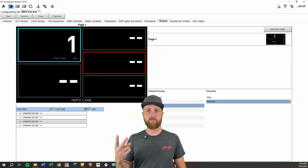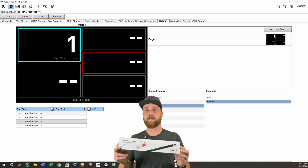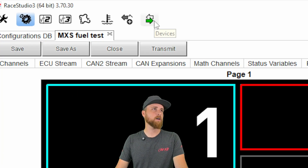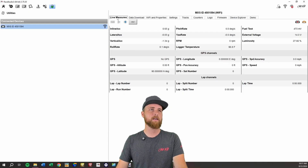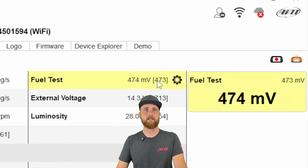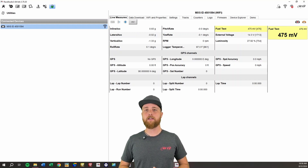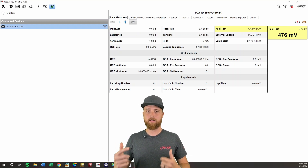Configuration successfully transmitted. Now our hardware is set up and we're able to receive a voltage signal from our fuel level sender. For this example, since I'm not doing this on an actual car, we're just going to use one of our Eclipse linear potentiometers to simulate filling the fuel tank. The next step is getting the actual data points we use for setting up our custom fuel level sensor. We're going to go to connected devices, click on that to populate the side, and it should default to the live measures tab — which is where we want to be. If we click the MV or millivolt button, that'll give us the millivolt values for all of our channels. Technically all we need to make the sensor work is two data points — a full and an empty reading — but for the most accuracy, start with an empty tank and add a gallon or small increments at a time, taking a millivolt value each time until you get to full. The more data points you collect, the more accurate the reading is going to be.